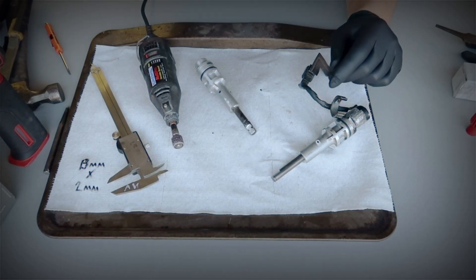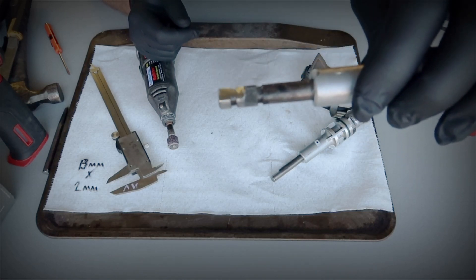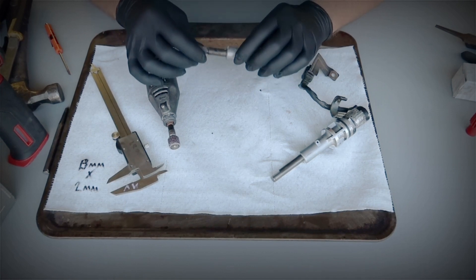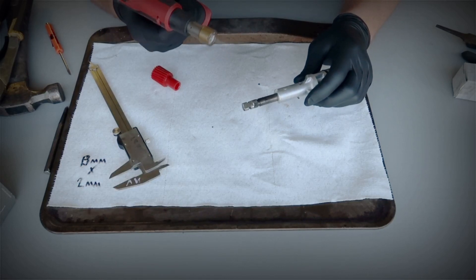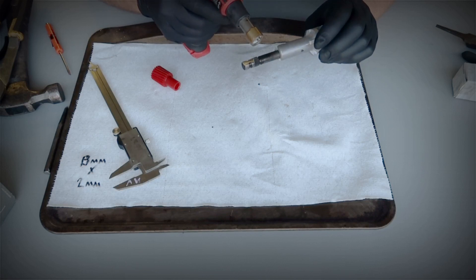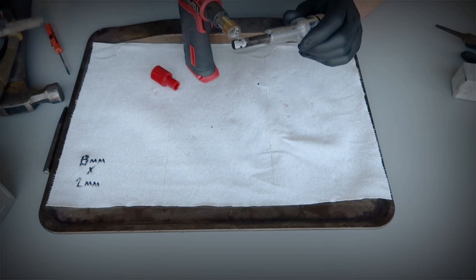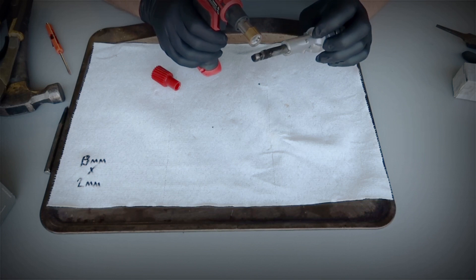We just finished up our shaft here. I did use a hand file to get that true 90-degree end stop. You have a nice 90-degree break there which will aid whenever you're pressing on the red toothed wheel. Everything looks good, so we're going to move into the next phase: we're going to go ahead and heat the shaft up. Don't get it glowing, but do get it hot. What you're going to be doing is pressing the red wheel onto the shaft, so get it nice and hot and get your work area cleaned up.